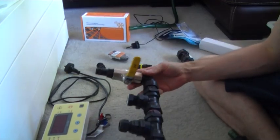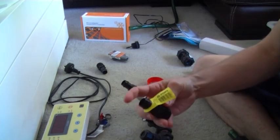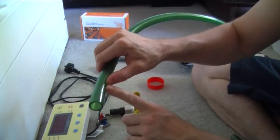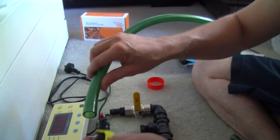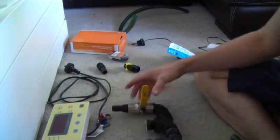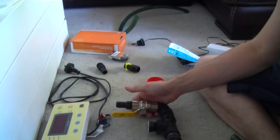On a very basic level, this is my first design. I used two of these little adapters that fit a 19mm hose — they will fit standard 16mm aquarium tubing. You'll need to submerge this in hot water for about 15–20 seconds and it will go on with a nice tight fit, shouldn't be any problems. I put these three-quarter ball valves, which I mentioned before — you can get them from the plumbing section — just to be able to turn the water off in case I want to pull this apart for maintenance.